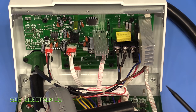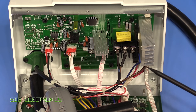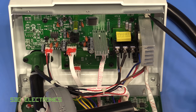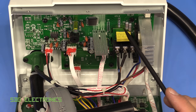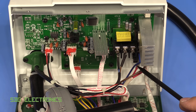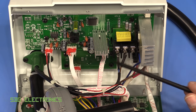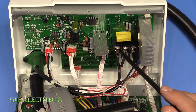Here we've got our front panel PCB and it's not too bad at all. On the right hand side we've got our heating element control — a massive 40 amp triac with a big heat sink for controlling the 1.2 kilowatt heater — and here's our optocoupler to provide the separation from the electronics, with a snubber network, capacitor, and some power resistors.